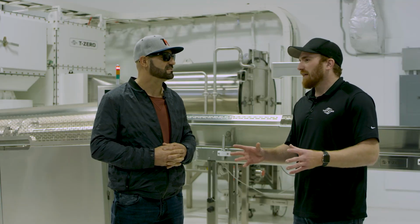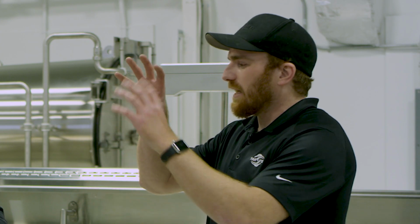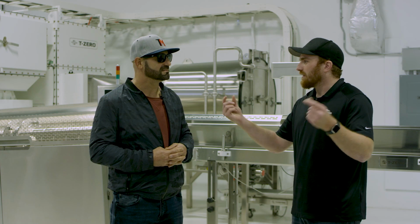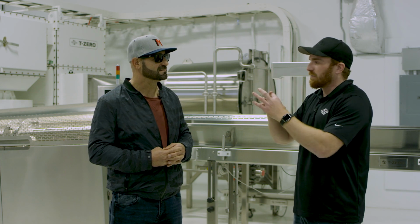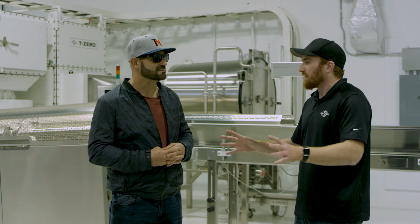On the actual blade inside the machine, does the size of that blade matter? Not so much. The reason for that is when you have a tumbler and this blade underneath, all there is is a little tiny slot. That's what the flower sees, and that's what does all the work. So if you have a really big blade with 200 blades on it moving really slowly versus a really tiny blade with 5 blades on it moving really fast, what the tumbler actually sees is exactly the same.